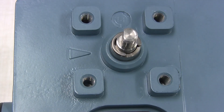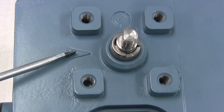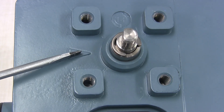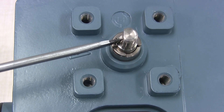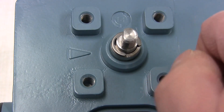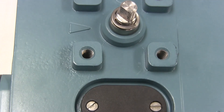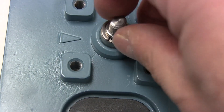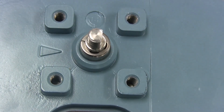The next and most important thing to note is the flat spot on the feedback shaft and the raised arrow on the housing. When the actuator operator is at 50% open, the flat spot on the shaft should be aligned with the arrow. The positioner will only operate 45 degrees to either side of this location, meaning a valid input position is 45 degrees before and 45 degrees after the arrow. Anything beyond that — for example, 180 degrees out — is an invalid position and will result in an auto start error when you try to calibrate the positioner.